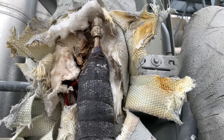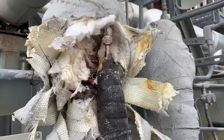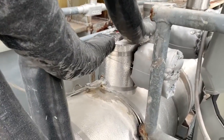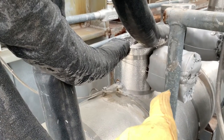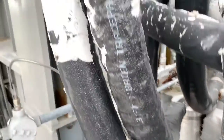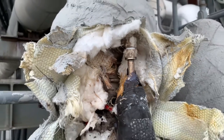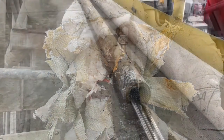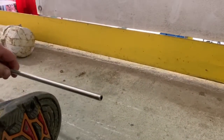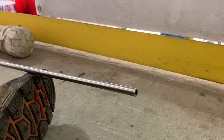For right now I'm leaving that open so it's not continually dripping water down in the transmitter box, and that way everything can dry back up. With the unit offline, we will shut that valve, check the pressure to make sure it goes to zero, pull that fitting off, and redo the fitting. First, we need to get a piece of tubing to put in our fitting to get the proper connection — we don't need much since we're just doing this for training.